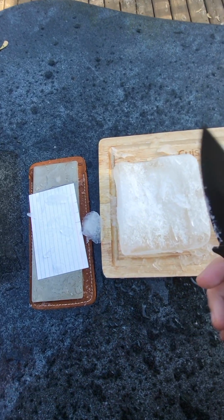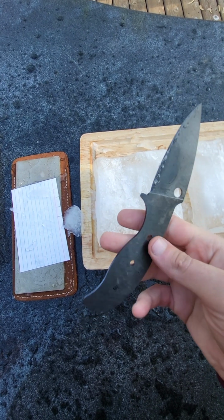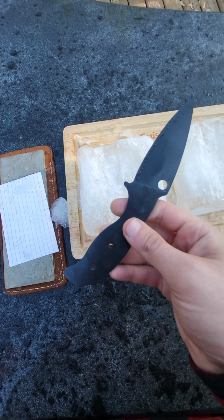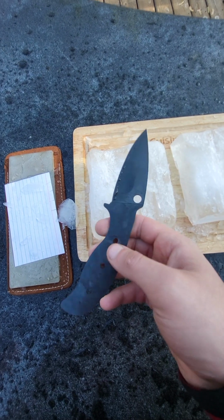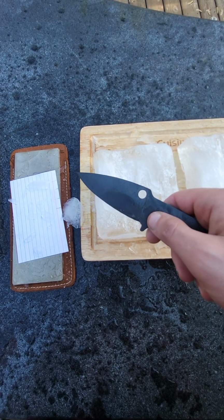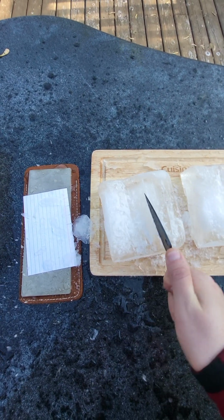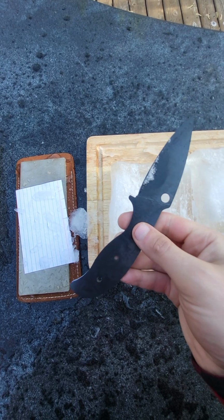Because the mule project, I feel so many people are just more interested in putting handles on there as opposed to actually providing real world feedback, testing results. This is what I do to actually analyze the abrasive wear, how tough it actually is. So far, this has been the most brittle alloy, or not technically a steel, that I've ever tested. I always have that 60% benchmark for steels, pass or fail. But when I was testing this, I was creeping up a lot more slowly, extending testing over 7 days as opposed to just one session. It didn't make it past the second day out of 7.